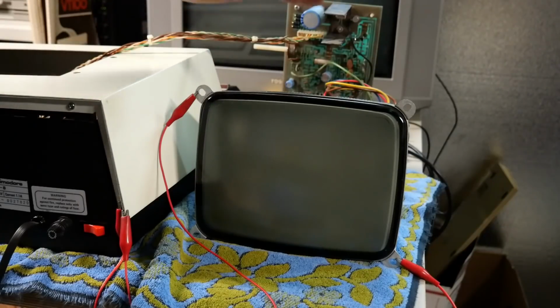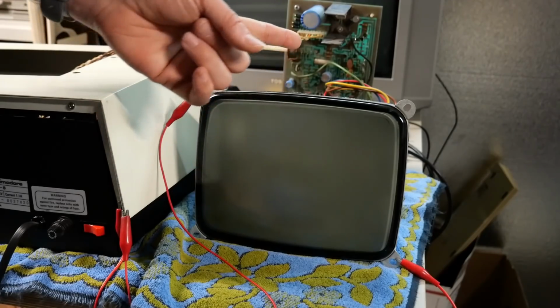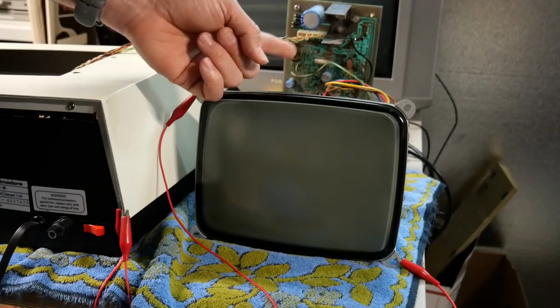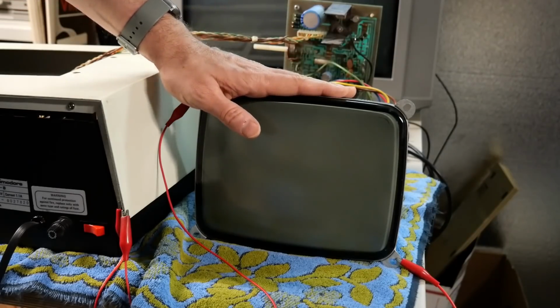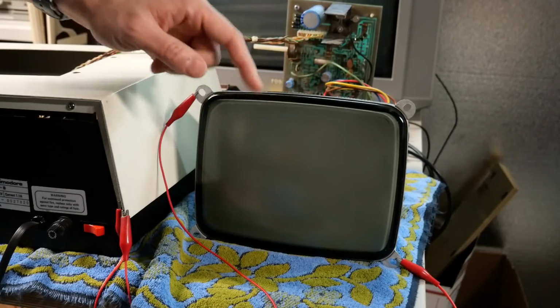To help with the process of elimination, I had the thought to use a different CRT to see if we got the spot on turnoff. If we do get the spot, then that surely tells us that there is still a problem on the PCB. But if there's no spot, then that definitely points to a fault in the original PET monitor.